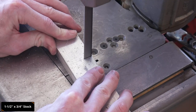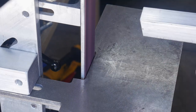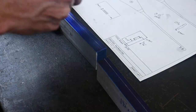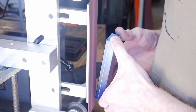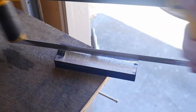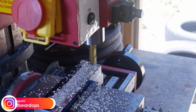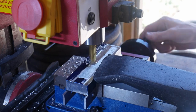This is actually some leftover aluminum from my surface grinder build. The first goal here will be to get both of these pieces nice and uniform and then mark out where my ledge will be. This ledge will allow these jaws to sit up on top of the jaws in the current vise. I'll be leaving around a 300 thousandths ledge and cutting into the jaws about a quarter of an inch. I first thought I'd be able to remove the bulk of the material with my grinder or a hacksaw, but that was not an efficient solution, so I went straight to my mill and busted out the half inch end mill.